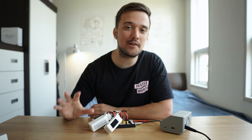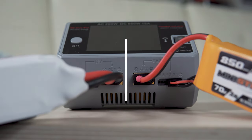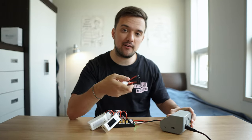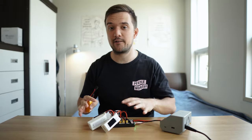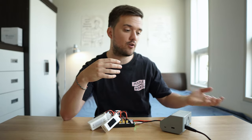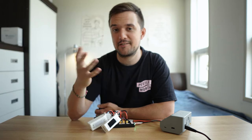Some chargers have two separate ports or channels that perform two different and completely separate tasks — anything plugged into channel 1 will not affect anything on channel 2. You could treat them as two separate chargers built into one. So even if I couldn't charge one 4S battery with the rest of them, I could plug it into a separate channel without any interference. I could even plug a 3S battery into channel 2 while 4S batteries are parallel charging on channel 1. The only thing to keep in mind is that both channels share the total amps they can draw from your power source, so there is a limit.